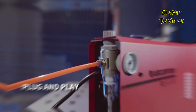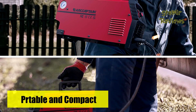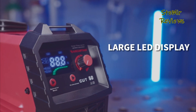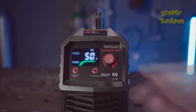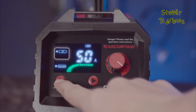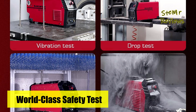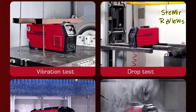For optimal performance, it is recommended to use a 50A current with a suggested PSI range of 20–40 PSI for 110V and 30–60 PSI for 220V connections. The plasma cutter features user-friendly attributes like a plug-in air filter connector and built-in regulator, simplifying installation and enabling quick setup in just 30 seconds. Weighing a mere 13 pounds, it is highly portable, facilitating ease of movement in any workspace, and adjustable post-flow time of 5 to 15 seconds ensures clean cuts.